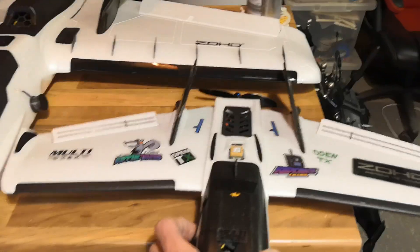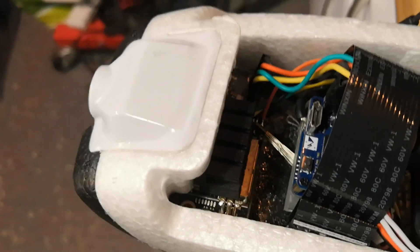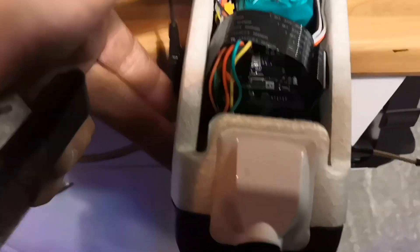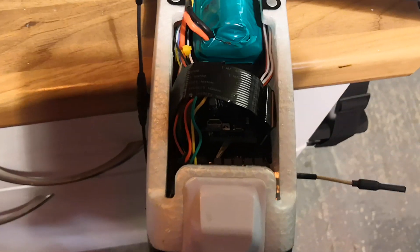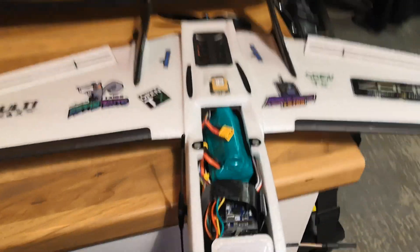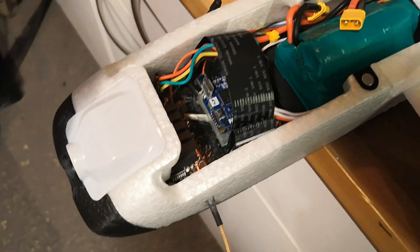Really don't want to crash this shiny new plane or the little Dart 250g. While we're talking about it, I'm fairly concerned about the way I've built this. Now having a lot more YouTube experience, I probably wouldn't have mounted the VTX right at the front with a massive heat sink on it, and I probably wouldn't have mounted this stack here either. That is the SD card cable extension. The CG is all good on this, but really I should have stuffed more of it up the back and moved the pack forward. I was just concerned about the VTX being near the ESC, and the short run cam cable doesn't help.